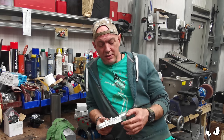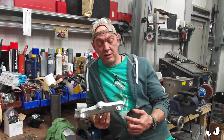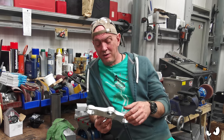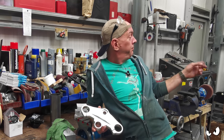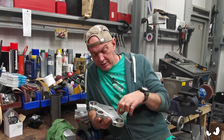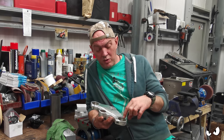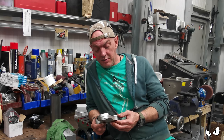So he chipped up with this. I spent bloody ages and ages measuring this. I've had everything down each of these holes that you can imagine. I've got a little vernier protractor jobby, I've got a digital one and everything else. I ended up setting it on the bed of Brian, and I ran an indicator down these bores, and they're all exactly cock on. It's not like one is at a different degree to another one. And that was the best way I found of doing it.